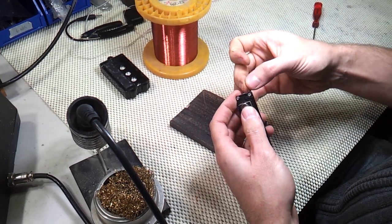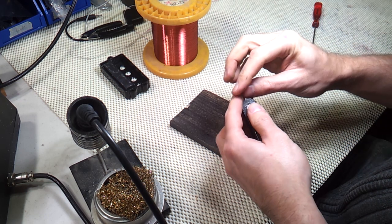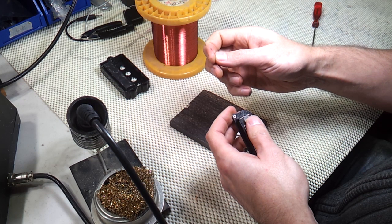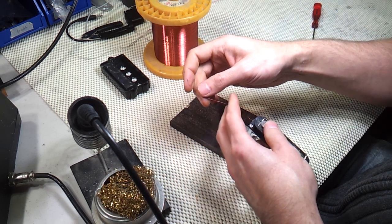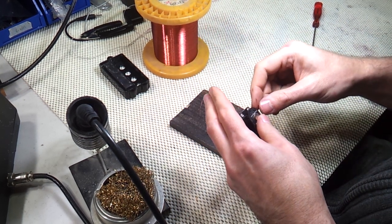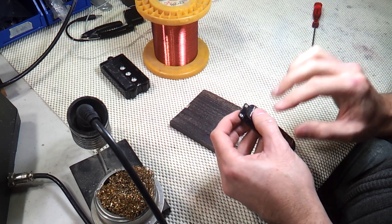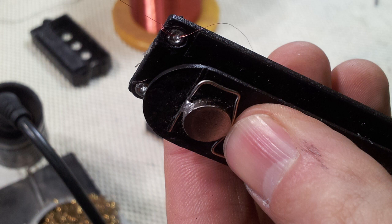So now it's the fiddly and slightly surgical task, I guess, of threading the eyelets. In this shot, I know it throws the white balance off, but I've pulled my overhead lamp in close so I can see what I'm doing. It's a good idea to actually wrap and knot the wire two or three times, especially since these eyelets are going to melt the plastic and move a bit every time you solder them.